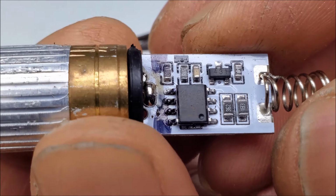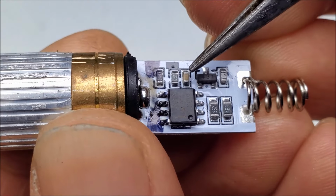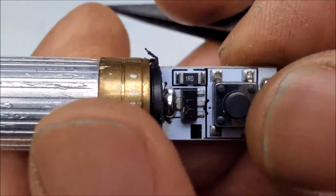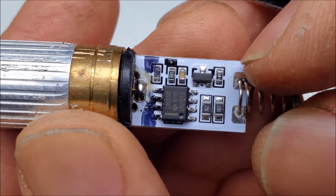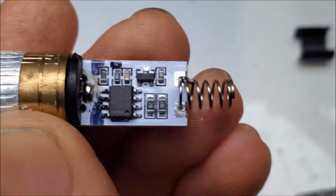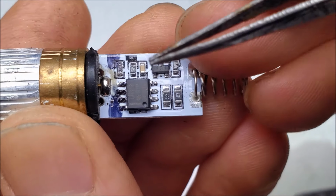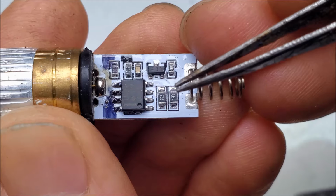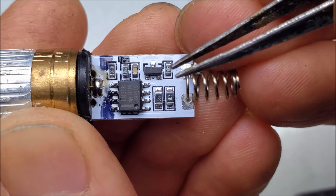Yep, okay. Couple other resistors. We still have 2 capacitors, full capacitor here. Okay, so they removed what capacitor? Looks like they might have removed an inductor. So 2 parts are gone. And they substituted the potentiometer for these fixed value resistors here. But it's still a constant current driver.